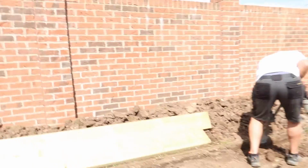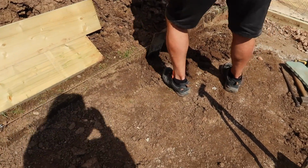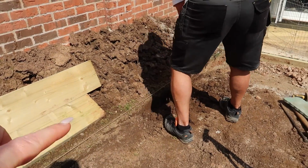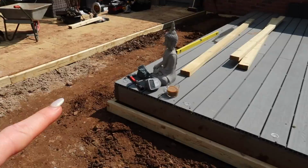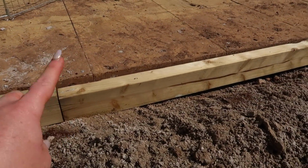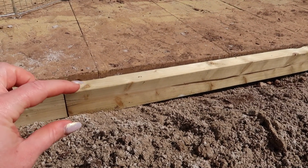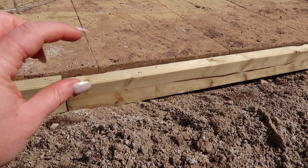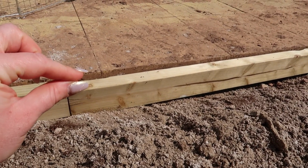It's a little bit of a tedious job, but as you can see what Dad's doing over there, it's basically just getting some footings, getting the trenches in the edges to make sure that the wood can fit in nice and level like this. So we're not actually going that deep, there's no need to. I've already talked you guys through with the aggregates and the sand how much we're actually going. So it's going to be 5 centimeters of hardcore compacted and then 1.5 centimeters of sharp sand.